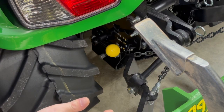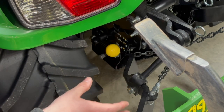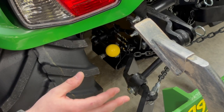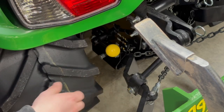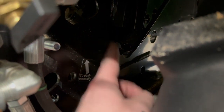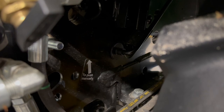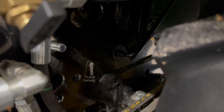I think that's all I've got for the controls on the machine. One final control I almost forgot: there's an arrow here that says push to push manually. You push that up and it disengages part of the transaxle so you can push the machine around. The thing is still really heavy so it's not super easy to push, but that is the final control. It's on the right-hand back side of the tractor, right inside of the wheel.